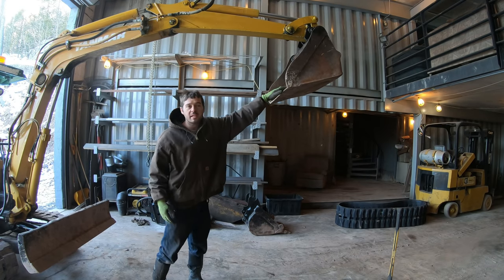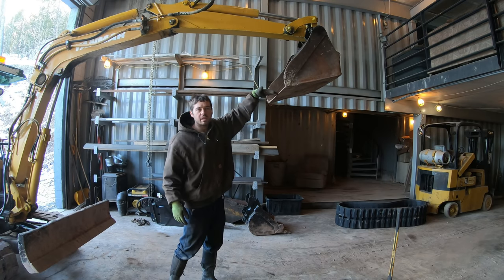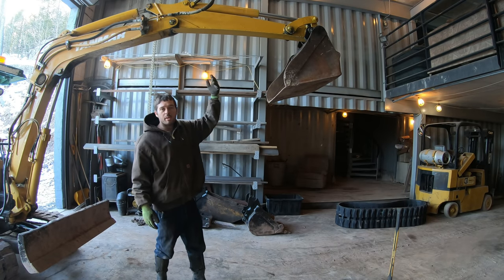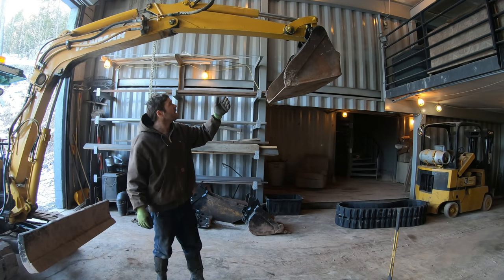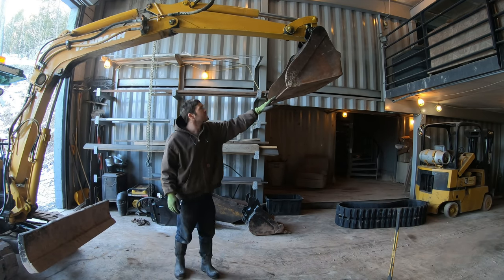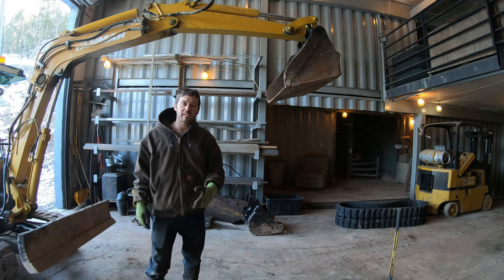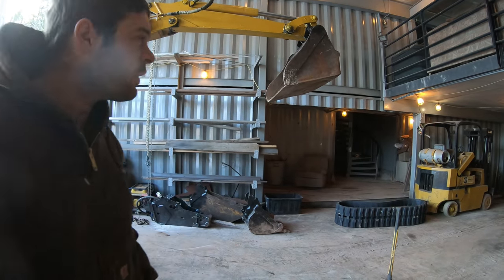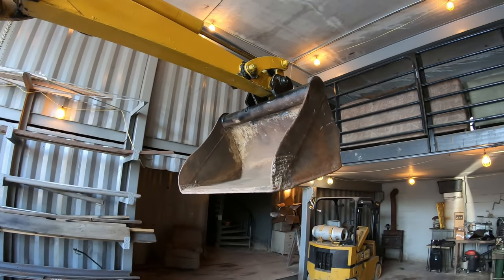See, remember here, this is as much as I can curl in. So if I was picking up material, this isn't even that high. Almost everything would be falling right out of the bucket, and that'd be really frustrating. The nicest buckets I see in some machines, they can curl and almost touch the boom, or in some cases even touch it. So let's see if we can fix this bucket to make it more useful for loading trucks